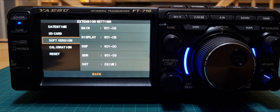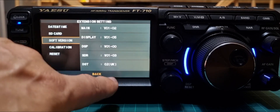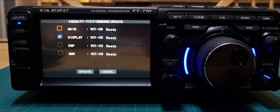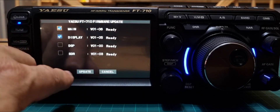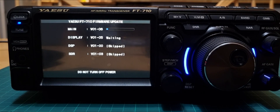Function > Extension > SD Card > Software Version. It now says version 1.05. However, the Main still says version 1.02, so it does need the firmware updating for Main. Let's give it a go. That is 1.06, so we go back to Extension > SD Card > Firmware. Do the file check — 1.06 is available, the other two look fine at 1.00. I've ticked Main again and click Update, because that does need doing. We are now doing it — let that complete.